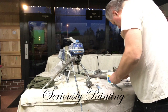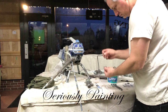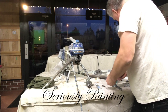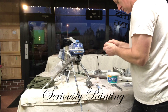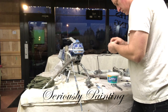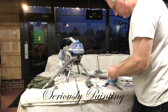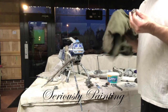Okay, now I'm going to take the brass piece at the top and take the rubber O-ring off the bottom and the seal off the top of it. Clean this and find the new ones. These are in the top of the package, top center. And once I've got them off, I will put them back together, the two black ones, and then screw them back onto the top of the housing